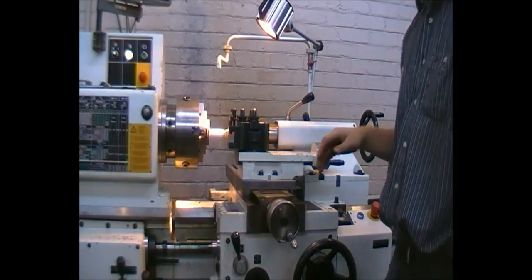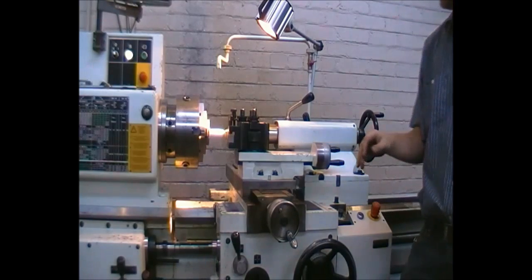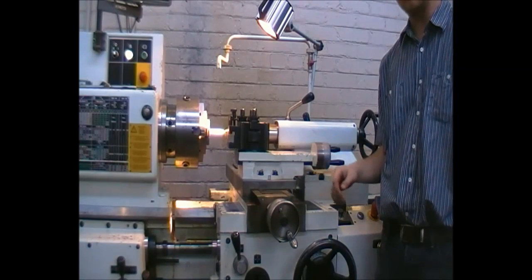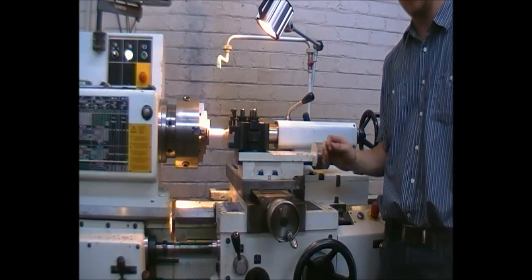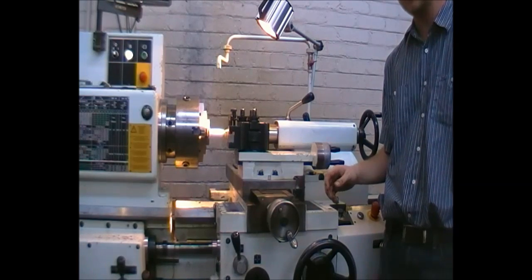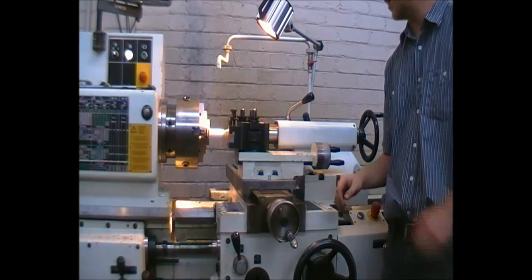Please note — for the beginning of your workshop, never take more than one millimeter cut until you are very certain you know how the lathe works perfectly. In small instances, please ensure to take smaller cuts but ask any of the instructors if necessary.